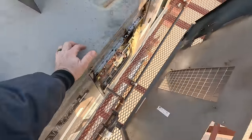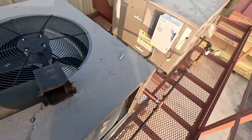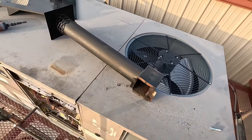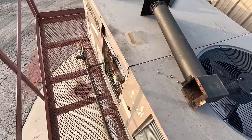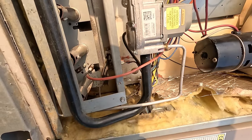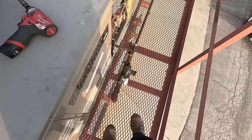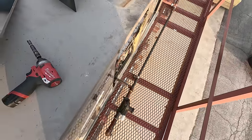The heat exchanger is completely sooted up. I don't know what they want to do with this now — you can try blowing it out, try washing it out, but none of the above is going to work all that great. It burns your eyes. Okay, just shut the fuel off to it; I'm going to let this thing cool down.